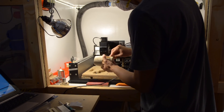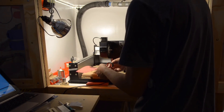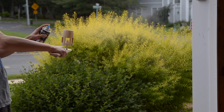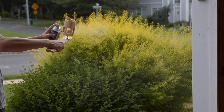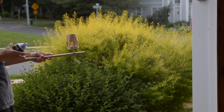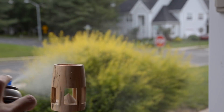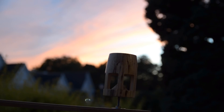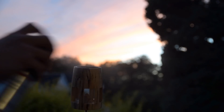Dammit Winston, stop trying to use old sandpaper. Fresh sandpaper literally pays for itself in terms of time saved. Alright, final stretch. Let's put a healthy coating of spray poly on this thing. Normally I'd think about hand-rubbed oil and maybe some wax for a piece like this. The spalted maple with smooth contours is just begging for a natural smooth finish, but since the speaker will be blasting podcasts in my humid bathroom, I'm going with a more protective polyurethane coat.